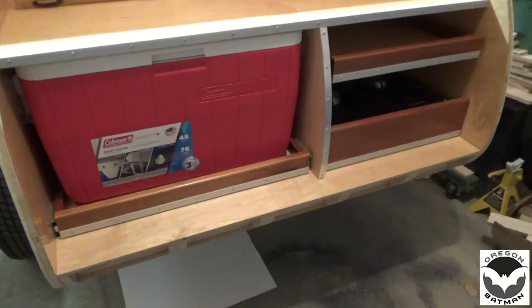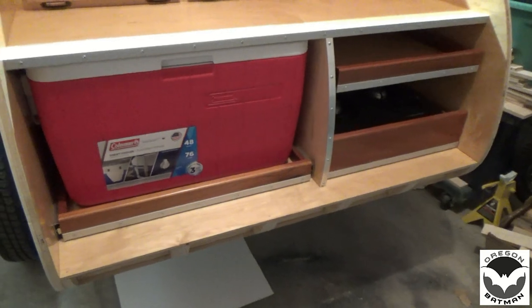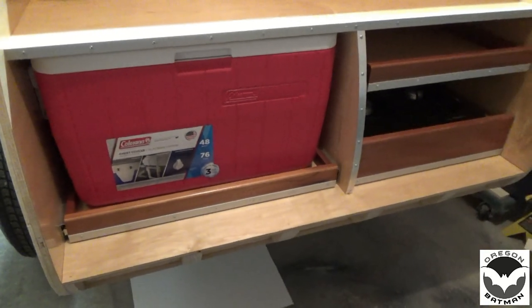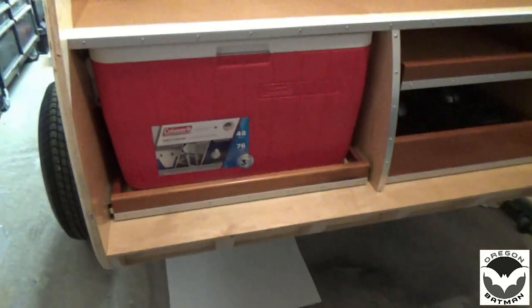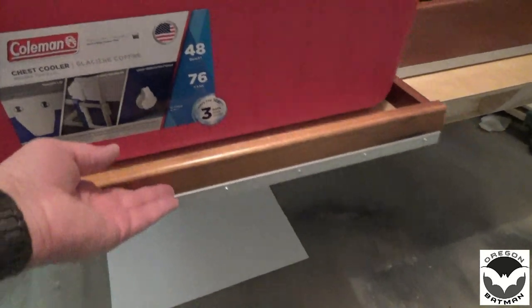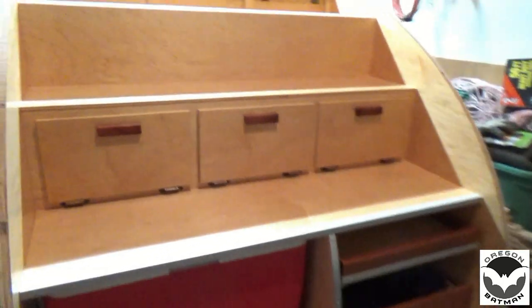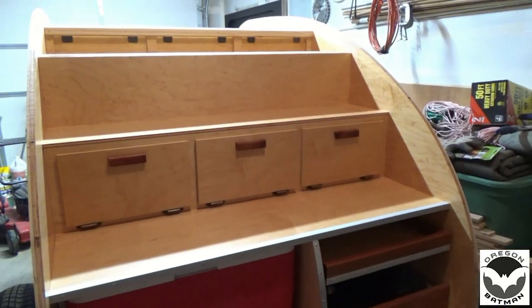The last thing I did to keep everything uniform in the back — not so much utilitarian but a little machinery-looking — is I installed aluminum along this top edge and this one here, and then went ahead and cut pieces for each of the bottom of the drawers and attached those. That way, when you're opening and closing these, if there's anything on the ground — a chair, tables, anything — if you bump into it, your drawers are protected. It gives it that look that it all belongs. We still have one piece of trim and a rail to put on the back, and once that's on, the back is done.